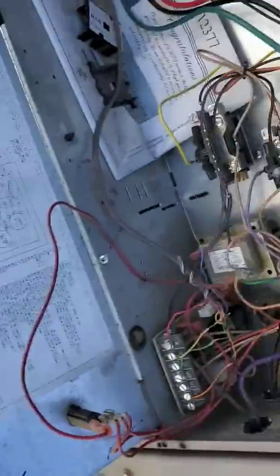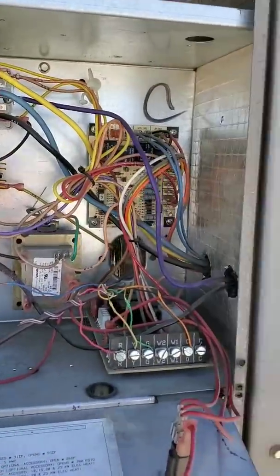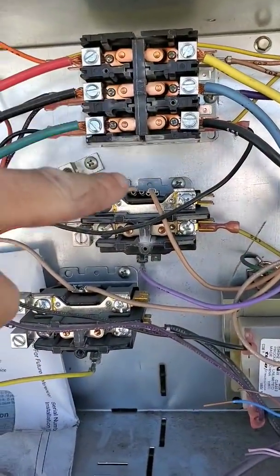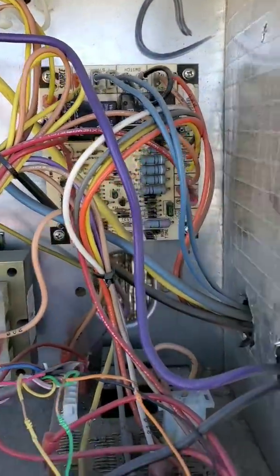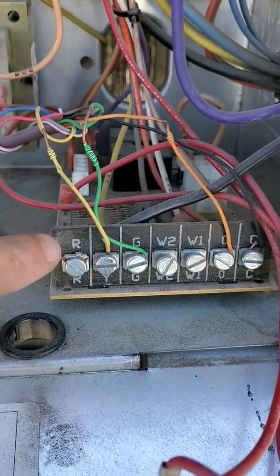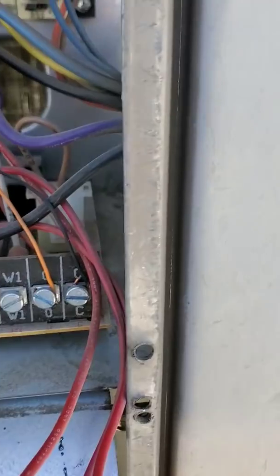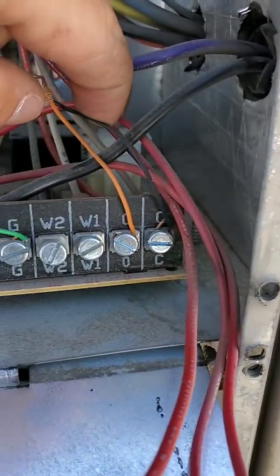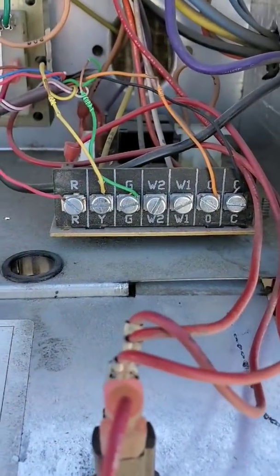Next thing I would do is check your electrical department. Here are your contactors. I'm thinking this one is for your compressor, and these two are for your indoor blower and your condenser fan. Then you've got your transformer, a control board back there, and a terminal block where your thermostat all ties in. Your red is for your power - your 24 volts. The yellow is your cooling. The G is your green, so that's your fan. And then you have black as your common, going back to your thermostat. When you have the 24-volt and your common hooked up to your thermostat, it doesn't need batteries.